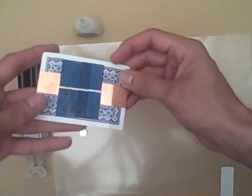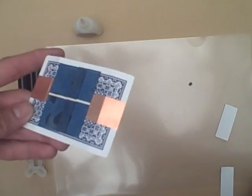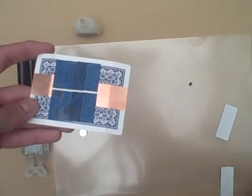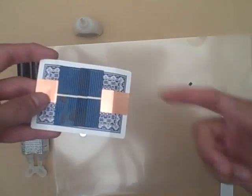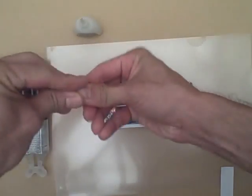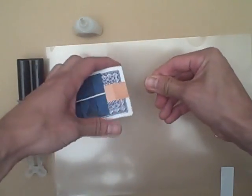Incidentally, the reason that the super glue works, even though it's not conductive, is that these silver ink bus bars and runner lines on the top of these solettes are a bit raised. So the super glue dries at the lower sections of the solettes, forcing the raised bus bars and silver ink runner lines to press into the bottom of the neighboring solettes. Then take a couple magnets, pop them onto your copper tape, a couple more, and that's it.